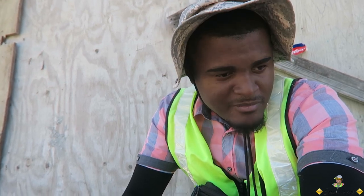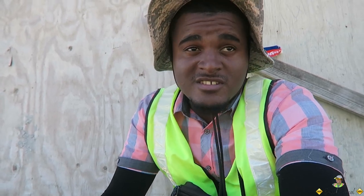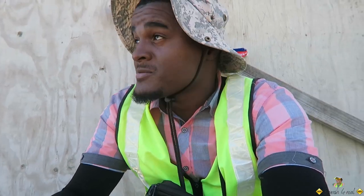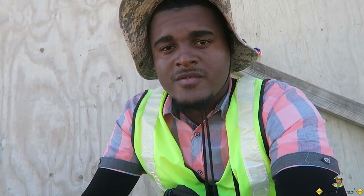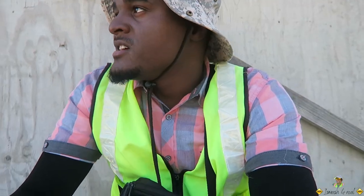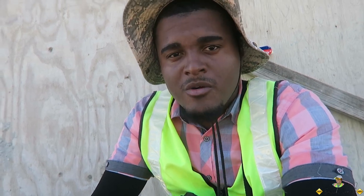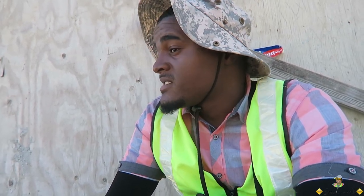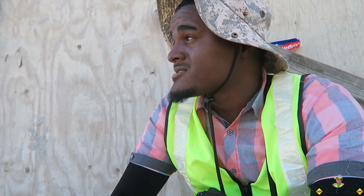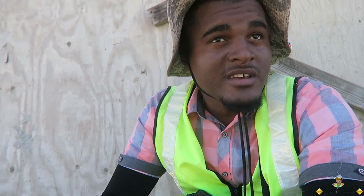Speaking from years and countless amount of sites, countless amount of construction of homes, I've never had a complaint, or heard of a complaint, especially for this type of unit, this type of development, of anybody having any leakage problem. So even if the roof slab is faulty, so far the compound has been holding up. I don't really remember exactly, but after probably 10 years or so, you can probably do another coat, because nothing lasts forever. It's a roof compound type of deal.